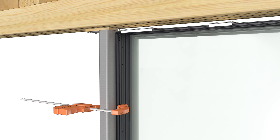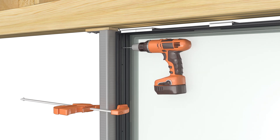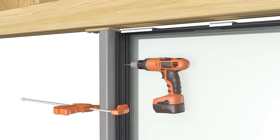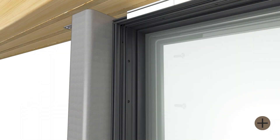Using the pre-drilled installation holes in the frame as a guide, drill through the steel with the number 23 bit. You might have to pre-drill with the 1/8th drill bit first. Fasten the steel to the frame with a number 8 by 1/2-inch trilobular screw.